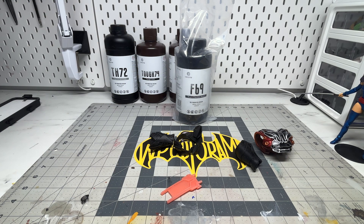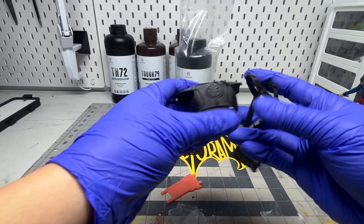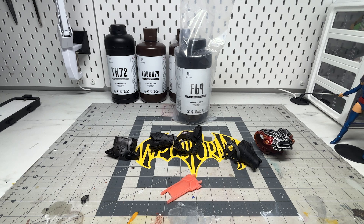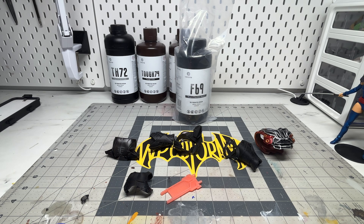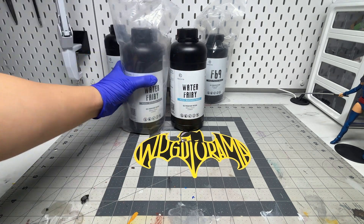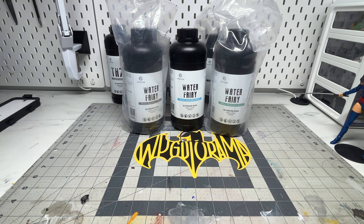The pink object is printed with F80, which is a much more rubber-like resin. The only disadvantage with this resin is that it is hard to clean due to how sticky and thick it is. You'd also need to use at least medium support settings to print it properly — around 0.45 millimeters of tip diameter. I also find that it is very temperature reliant, so at least room temperature or you might need a warmer for it.